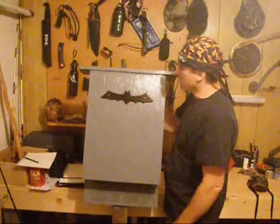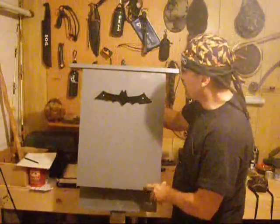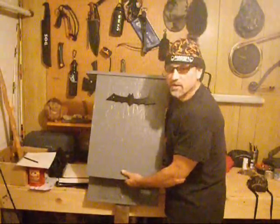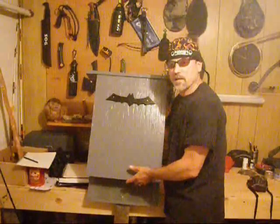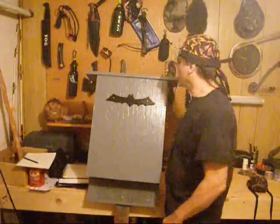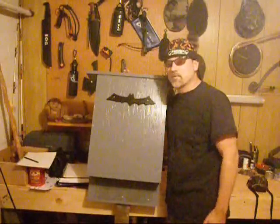This is my own design. I cut it out with a jigsaw and spray painted it. This is an exterior primer and paint — it's a water-based paint. I don't want those heavy oils bothering the bats. I did not paint the inside. Some people do stain with a water-based stain on the inside, but I chose not to. I believe it's going to hold up quite well just as it is. I sealed every crack and every crevice with caulk, and it's got a coat of primer and three coats of paint.